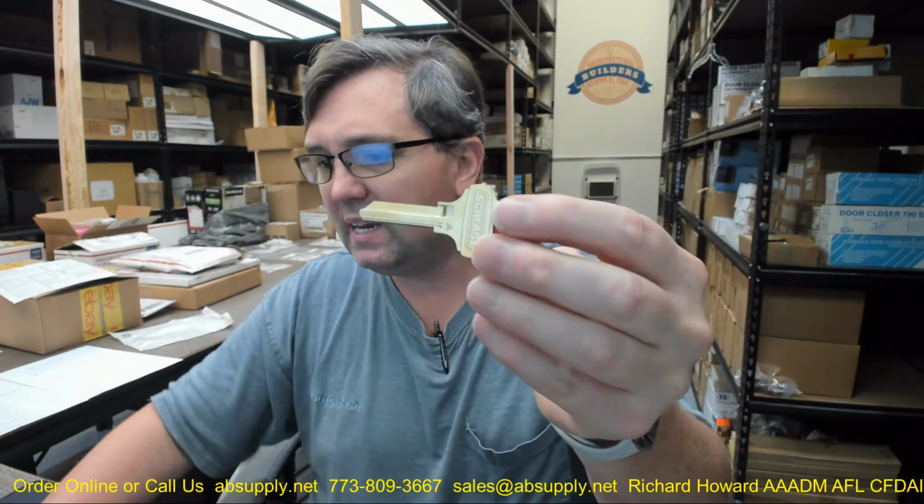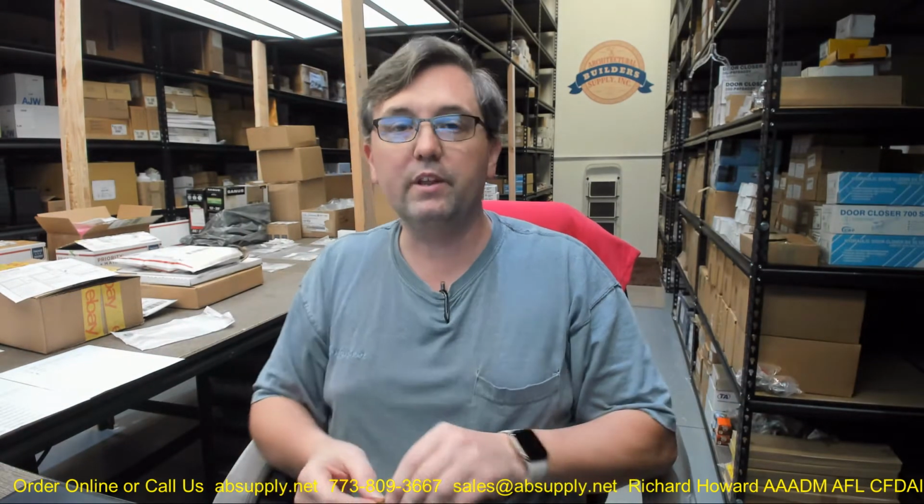This is a C family of their key blanks. For the overview, there is a link below this video to the cut sheet, which is where I will derive the following information from. This is a C family followed by 3 digits, and they use C only because of how ubiquitous Schlage C is. It is a C family, but now we've got different profiles. There's C134 through C345 set up in a multiplex system.